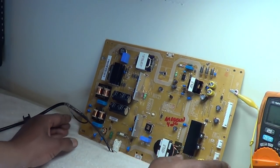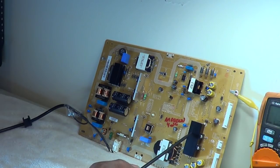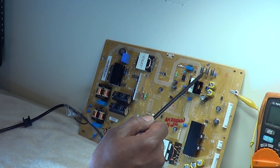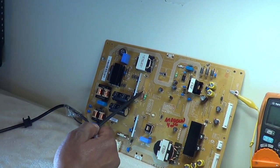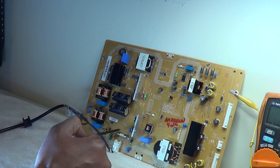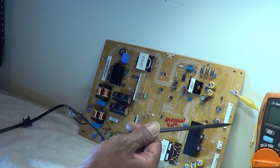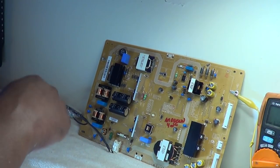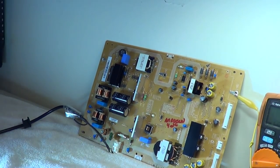Definitely check things on the secondary side — MOSFETs on these heat sinks and these nice power diodes here, and also these here. Most of the time, if you get a short on the primary side it'll just blow the AC fuse and you won't get any standby voltages. But anything on the secondary side — that's what's going to cause a jumping up and down reading.